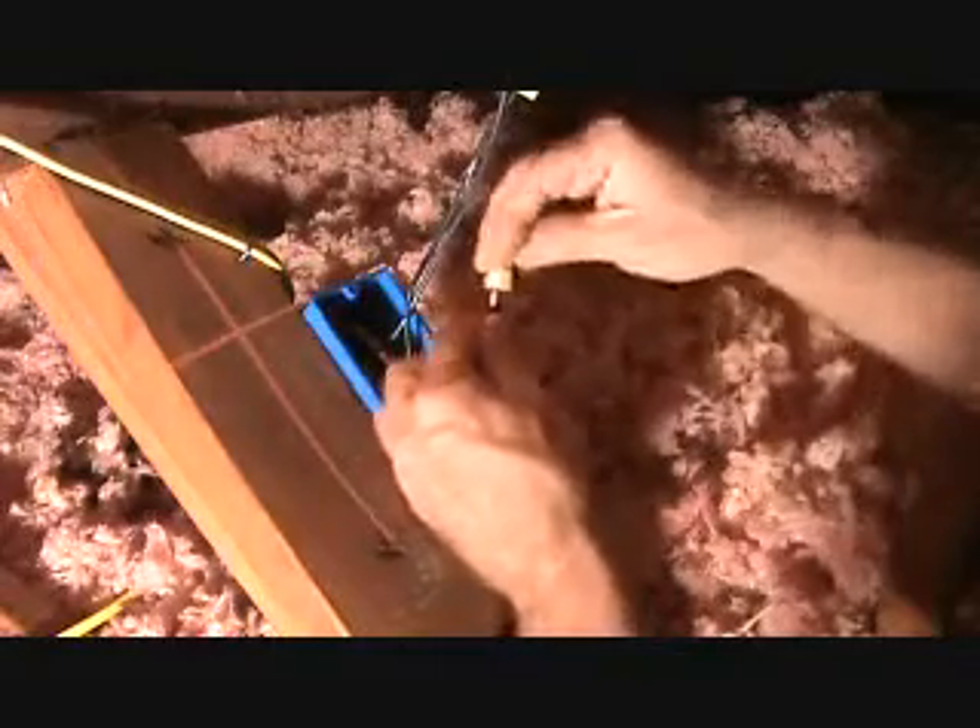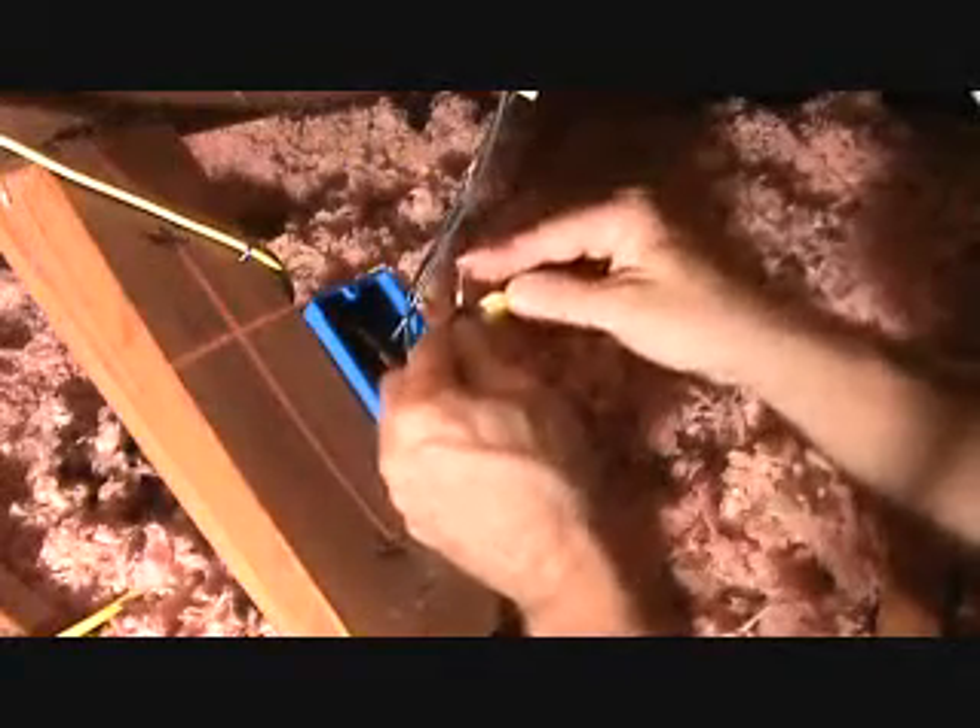Let's go ahead and hook up these wires. I should have made that one a little bit shorter but I didn't. If I was using red wire nuts I would strip it a little bit longer, but because I'm using yellows — since I only have two wires — I don't make it as long. If I make it too long and screw this on, you don't want the bare copper sticking out the back side. So I hold those up there like that and put the wire nut on.